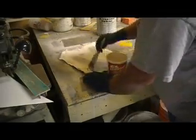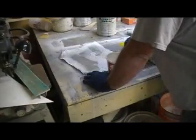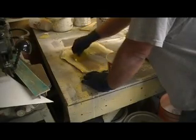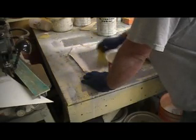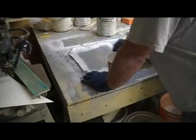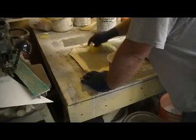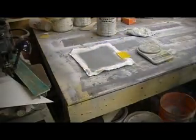We don't want to go overboard here — we still got resin on the bottom that'll soak up. We'll take that and spread it around. Let this set five or ten minutes while I do the rest of these parts. Make sure all that glass gets saturated and there's no light spots. You know, this is just a door — I still want it to look good.